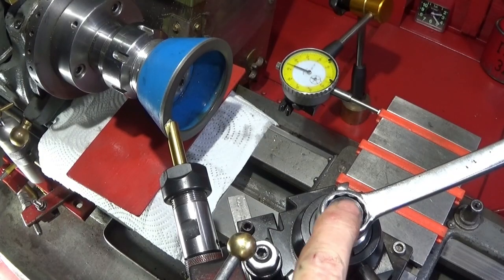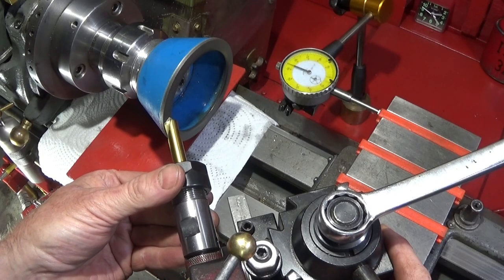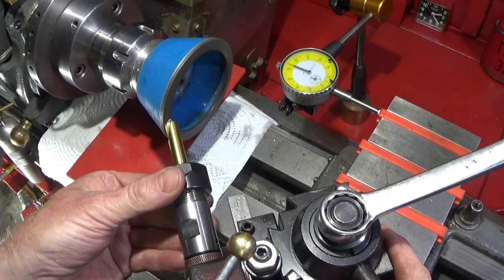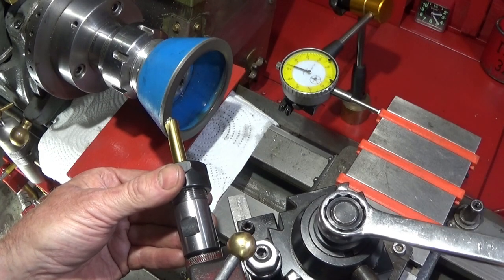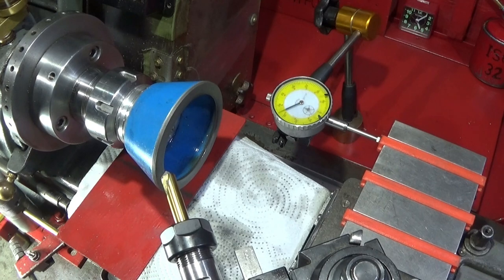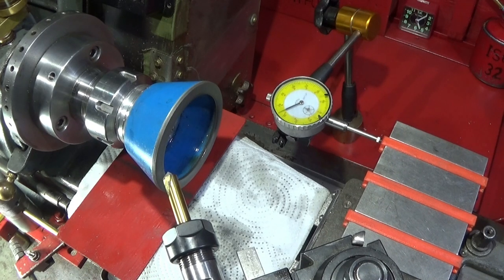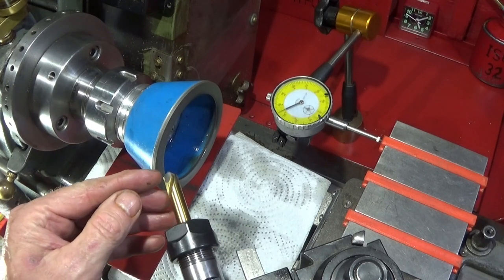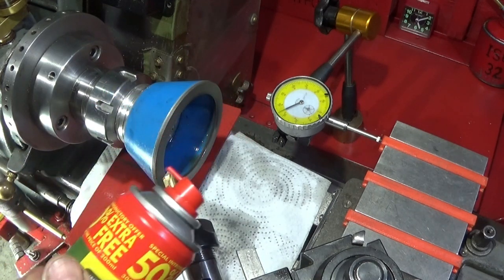Just to show you again - I've loosened the tool post nut and I'll show you how I set the angle. You can pull the tool out until you get it nice and flat on the front face of that diamond cup wheel, then tighten the tool post up. You can see that I've zeroed the clock on the carriage so that I'll be going into exactly the same position for each side. If you've just set one of these up, you can blue the end, keep the diamond wheel dry and do the first grind to check you're correct on the angles. When I'm using it I spray with a WD-40 type oil.